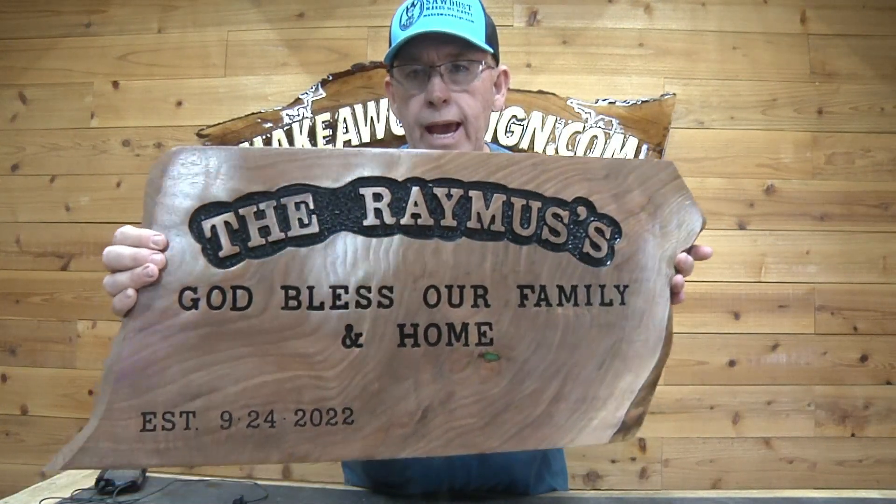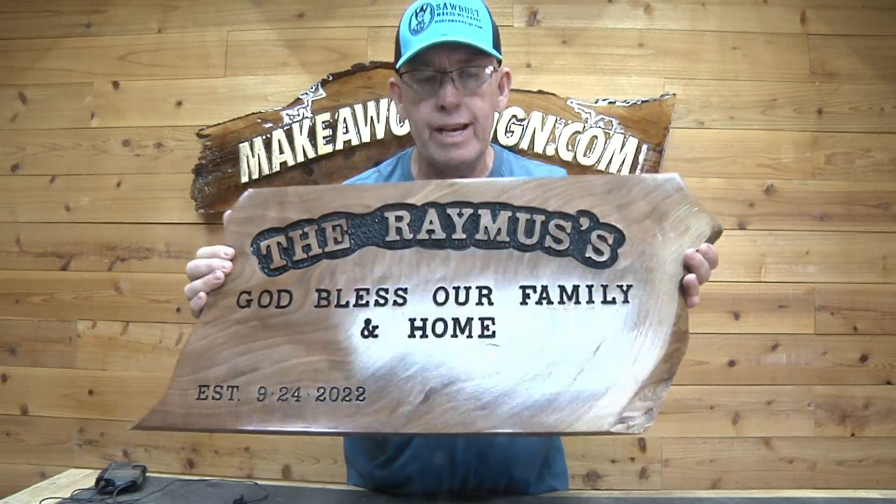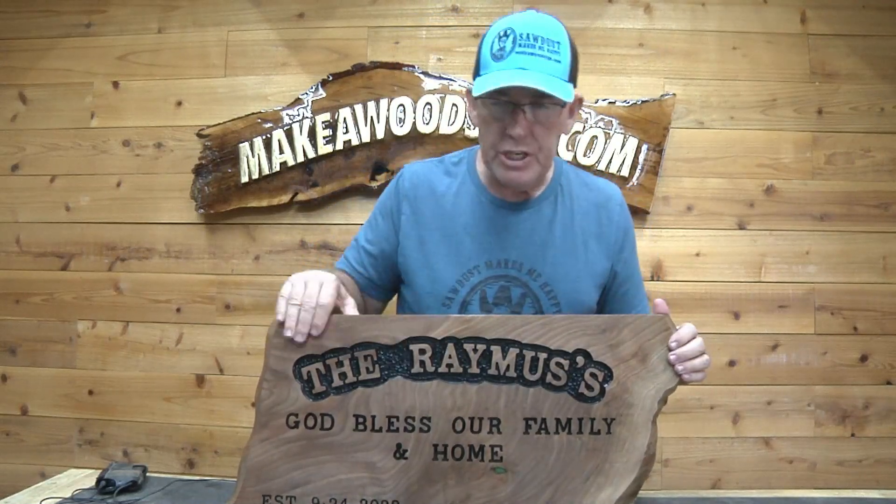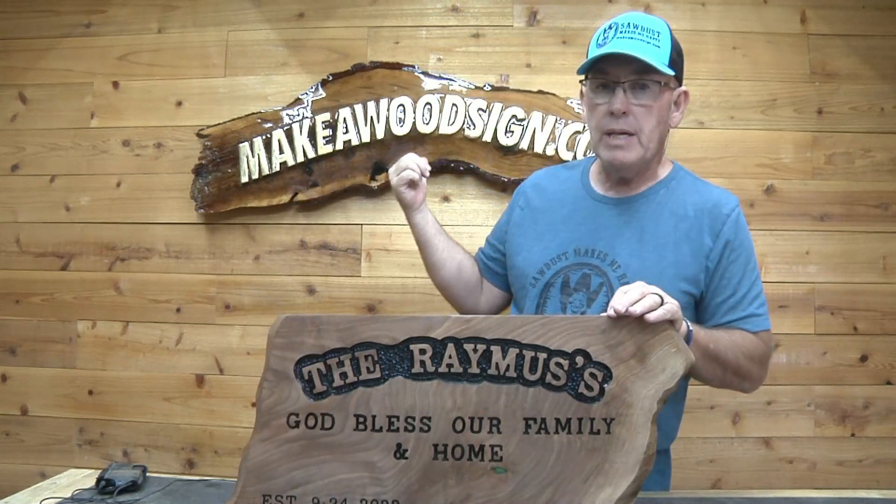There it is — it's all done. This is solid walnut and I really love the way it came out. I put three coats of the Zar exterior water-based polyurethane on it; it's got a really nice, super smooth finish. I sanded between coats just to knock down the edge. It's ready to ship off to the customer. For all the new subscribers — thank you so much. You can always email me at eric@makeawoodsign.com if you have any questions. We've got 1,800-plus videos, and we sell supplies, router bits, base plates, and all that stuff on our website. Thanks again, we love you — see you on the next one!